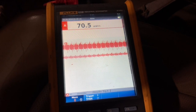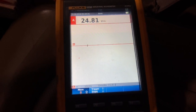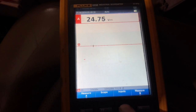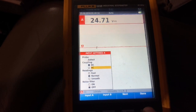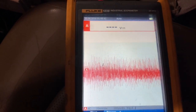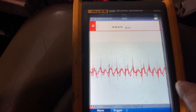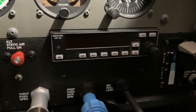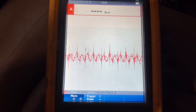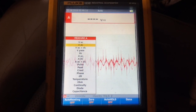I had a bad connection to the bus — now with power on I'm reading 24.8 volts. Setting the inputs to AC-coupled, I'm filtering out the DC. It's picking up noise from a hidden turn-and-slip indicator that runs behind these G1000s to drive the autopilot — this one has the old KAP 140 autopilot so we're getting interference from that motor. Switching to DC volts: nine millivolts.